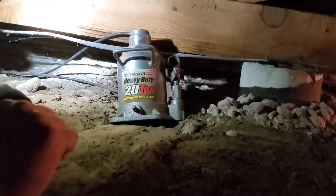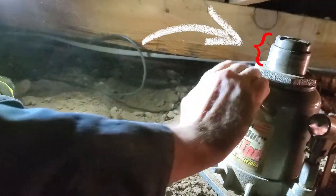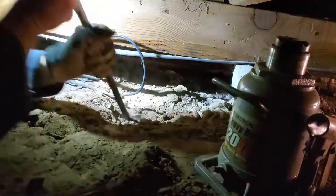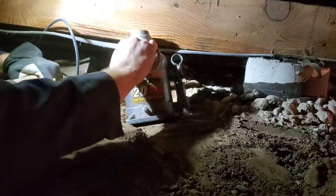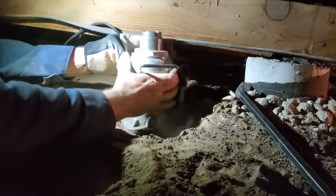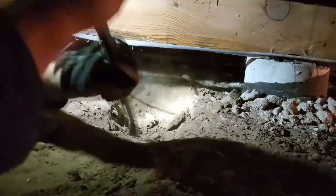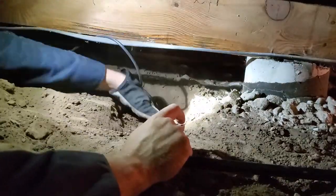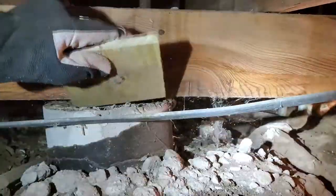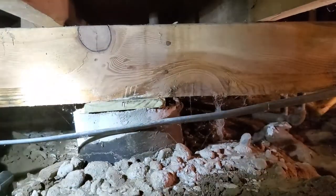Let me be real with you for a second. I spent 15 to 20 minutes underneath this house digging dirt with a crowbar because I hadn't pushed the jack down all the way and was too blind to see it when I was underneath the house. I really had no idea until I was reviewing this footage. Despite digging a needlessly deep hole for the footer of my jack, I was still able to get the beam lifted. The floor needed to be raised about half an inch — these shims were 3/8 of an inch and the asphalt paper that was there was doing nothing. So I put one shim in to see how it affected the floor, then would determine if it needed a second one after going back up to measure.